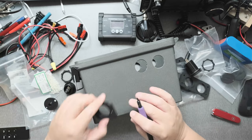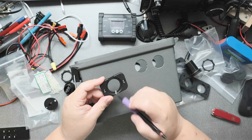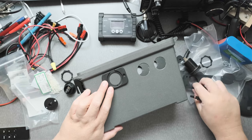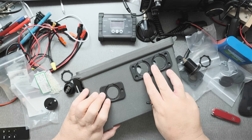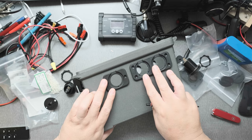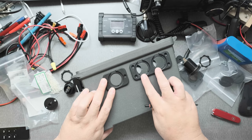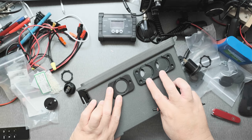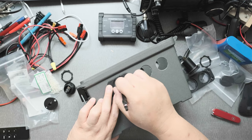I'm going to use this template and draw a circle. The hole size is one inch and one eighth. I'm going to put a hole here to put the switch — the switch comes with a nut so you can tie it on the back, and it has two pieces. This is great as a template. I'm going to draw a circle and then drill a hole. I'll just eyeball the placement. I'm going to use a pencil, and you can use a marker if you want; the pencil's a little easier.